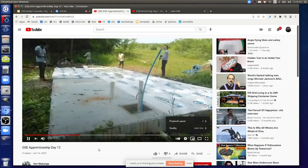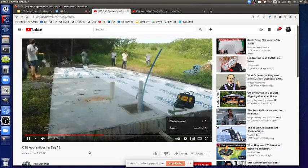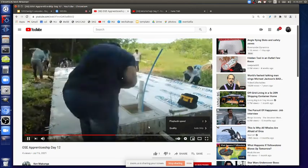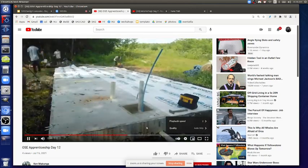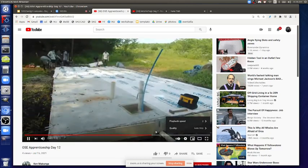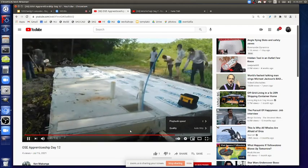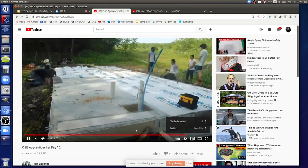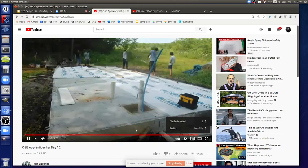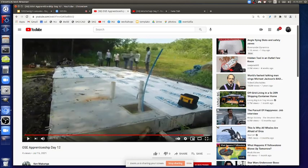A little bit of weed whacking around, a little bit of digging. So the cement board, like on the front here, you should see that it covers the insulation at the end of the day. Yes, that does. Cement board is painted white, so this is actually what you'll see at the bottom of the house, with a little bit of the vinyl flashing, that's the water detail. And you see the anchors, like in the corners, right there.